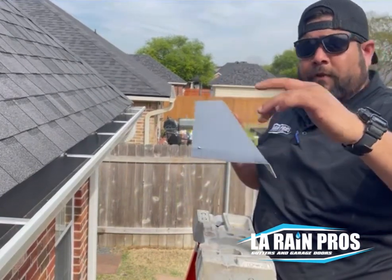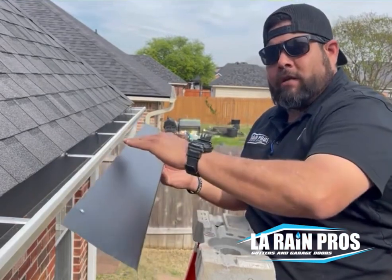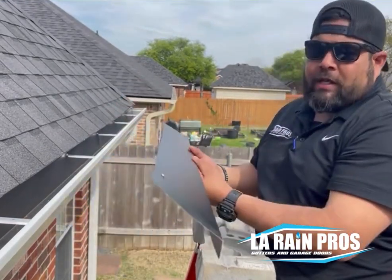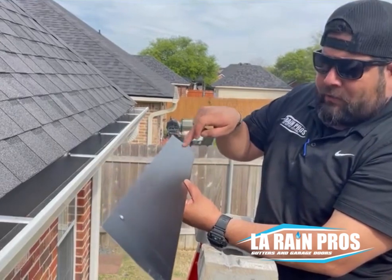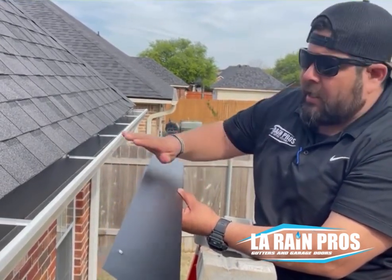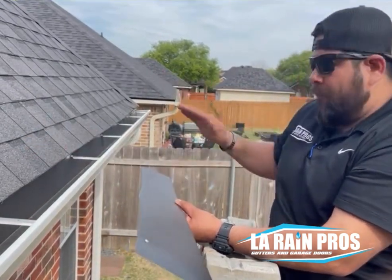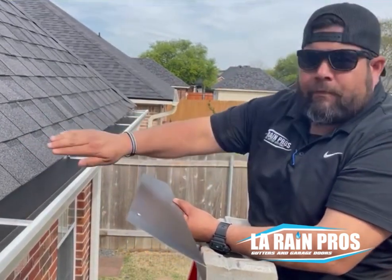This drip edge is four inches from the front to the back and it's designed to slide between the decking and the shingles. Once we get that up in there, we're going to hit some screws in there — some one inch lags — to make sure that we're low on the decking and you don't have very much reveal on your roof. By reveal, we mean when you're on the ground, you won't see a hump from the screw being there.